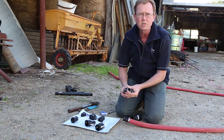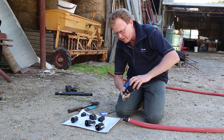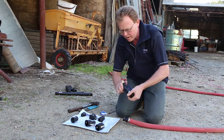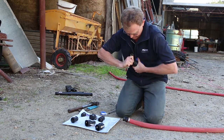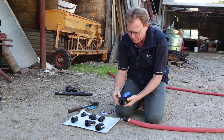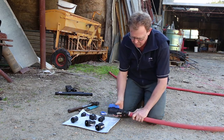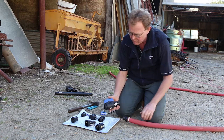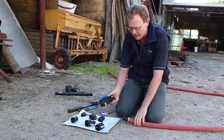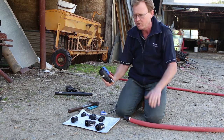If you're unsure, you can always do a dry fit first. That's in place. I've got my Filmac Blue Handle ball valve, and I can feel it's already going nice and tight as I put the two together, so we'll get a nice seal. I've made sure the two arms aren't going to interfere with the handle. We'll now walk over and fit this to the pump, interconnect these two, and we'll have water running through the hose.